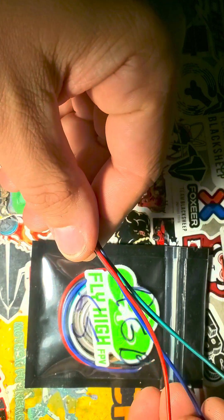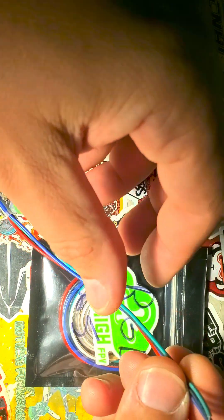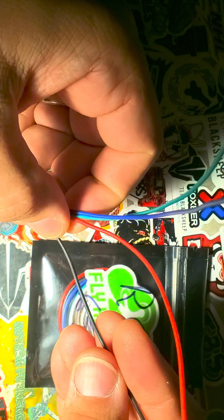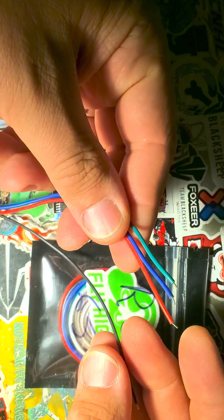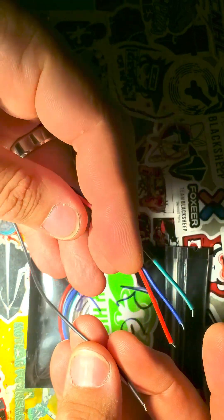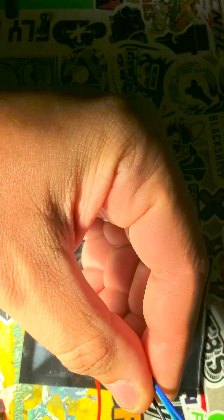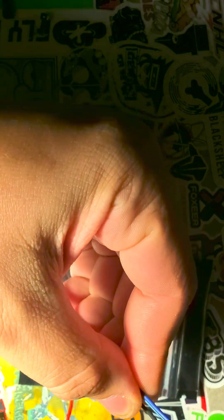On this end, the colors are going to be a little different than you're used to with wiring. Red and black are not power and ground. The way that these work with an RGB strip is: black is power, and then the three colors — red, blue, and green — are the grounds. That way you can plug them right in and if you wanted to, you can even direct wire. So again, black is positive and the other colors are the grounds.